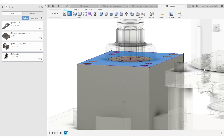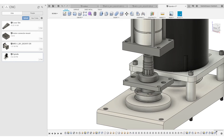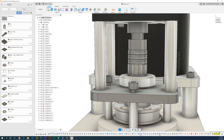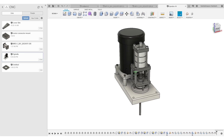This gives us two more problems to solve. First, we have to have a way for the air cylinder, its air lines, and all its mechanical bits attached to the spinning part of the spindle without everything getting twisted up every time you turn on the spindle. And we have to find a way to gear that cylinder down in a compact and simple way. Luckily, the second problem has already been solved for us by Fabco. They make this really sweet multi-staged air cylinder that does just that — it uses three cylinders instead of just one to get three times the power, no gearing needed. The other problem isn't too hard to solve either. We just need to design something that basically sits out of the way when the spindle needs to spin, and engages the spindle when you need to do a tool change. That might look something like this. Well, this was supposed to be a one minute intro and we're a good six minutes into it, so let's actually start building something.